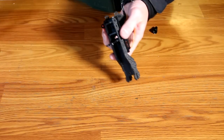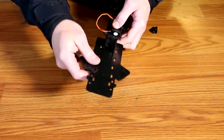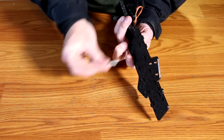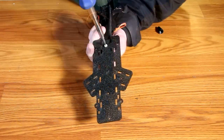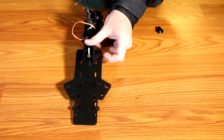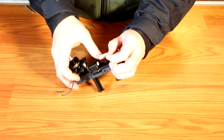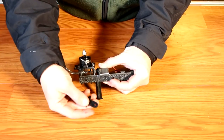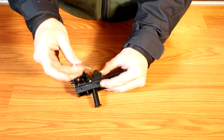The landing gear is completed with the other mating piece. Simply add a little bit of glue and, placing the short leg towards the back, slide it up into place. Install the rear arm assembly into the bottom plate — the bottom plate is the one with the two slots cut out of the back. Simply snap this into place, then take one of the long nylon bolts and place it up through the bottom. Then take a single nut and screw it all the way down, tightening down to ensure very little play in the assembly. The servo is likely to need shims so that the axle on the servo and the axle of the swivel pivot align. For this, I'm using double-sided tape — simply lift up the servo, drop the shim underneath, and then to secure it, use the T-shaped pieces with the hole in the top. These go through the slots in the side with a long bolt going through the top, securing the servo in place. Zip ties may also be used instead.